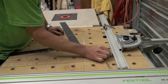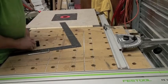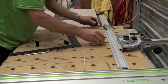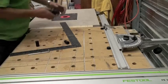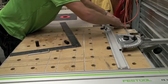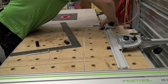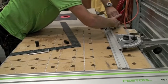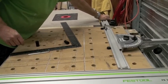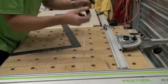How do I test if it is accurate? Do that. There — that is kissing. If you are going to use it in this position, with this slid under here and you are ready to cut — for those people who say they have problems with deflection, here is what I do. I make sure everything is loosened up, take the outboard clamp, I do it all with one hand and I do not have big hands. I hold everything, tighten this down. Now, can I move this? No. I can move the camera, I can move the table, but I am not moving the fence. I am pretty certain I will be able to work comfortably doing that.